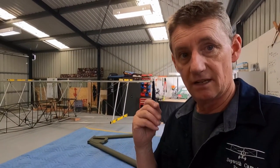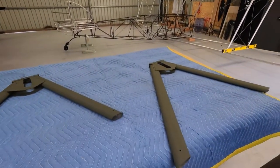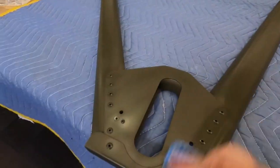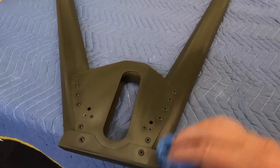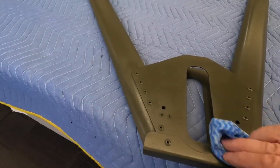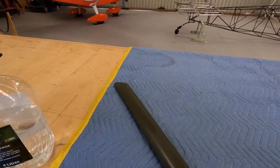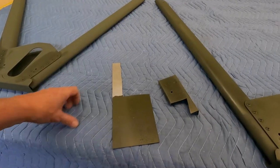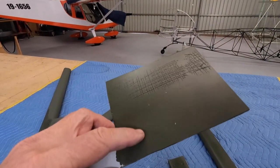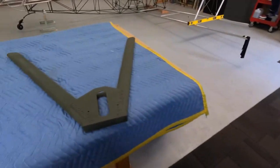What I have learnt: first thing, wash your hands. Get all the grease and rubbish off your hands, and then just lay them down there, try and limit the scratches, and let's do it. Just hitting them with a wax and grease remover - Windex works well as well - and just get the dust off. There's like green dust coming off so it sort of sands it a little bit, and also gets your greasy mitts off it. I've learnt a lot with painting lately, especially after the cruiser - cleanliness is the go. I also do a few test pieces. This one was terrible with the water-based paint. This is the duck shooter paint with the clear coat on it, so it should be compatible - but we'll see what happens.